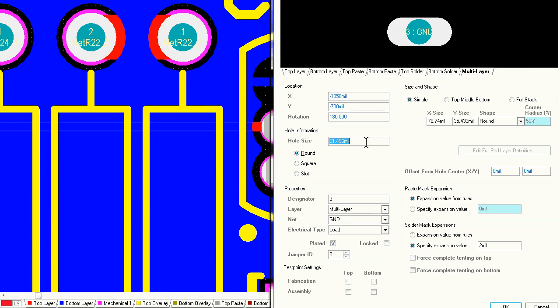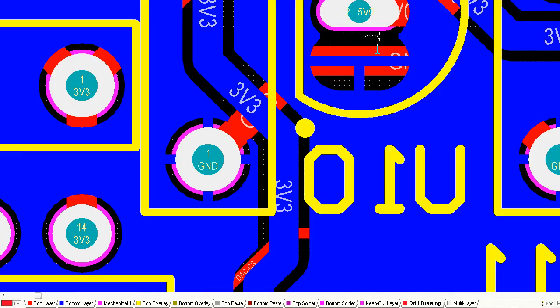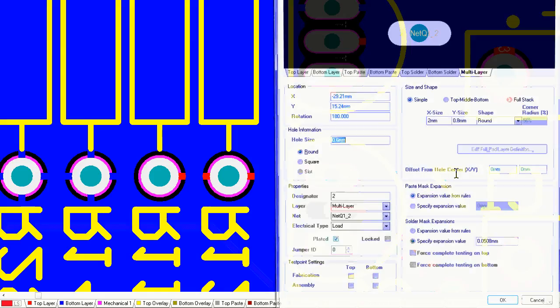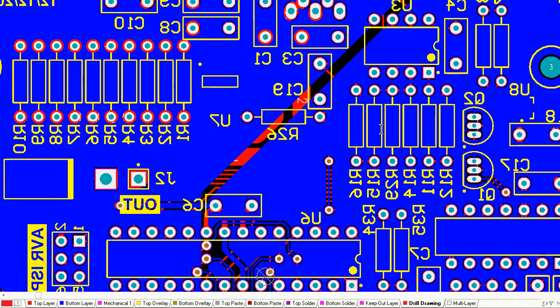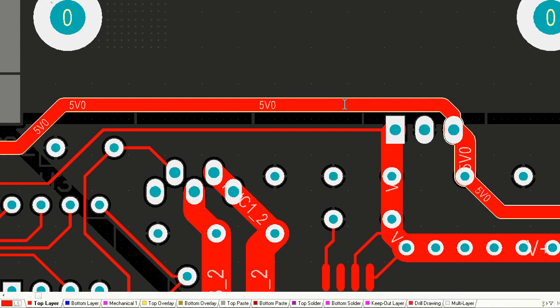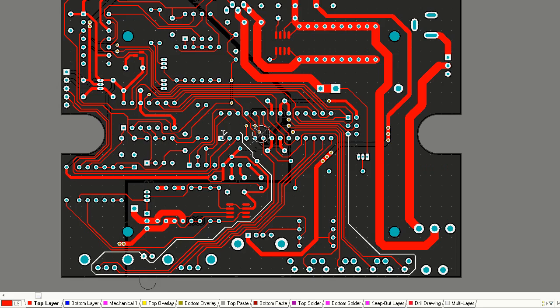So I'm just making sure there's a good thickness, 4 or 5 thou gap, of solder mask between pads. That would be good enough. Anything less, you get down to a couple of thou, then they're not going to be able to manufacture that. Just like they can't manufacture a 2 thou trace reliably, or if you want them to, it'll cost a fortune. So really, this board is very coarse. In terms of design rules, it's like 10-10. I forgot to mention that before.